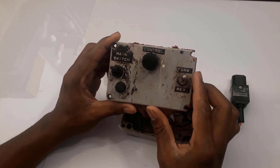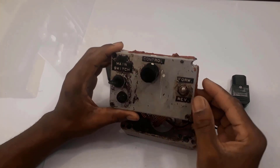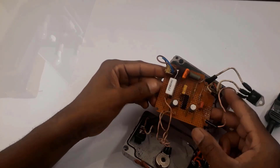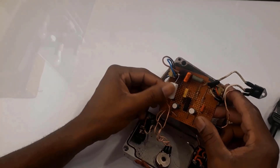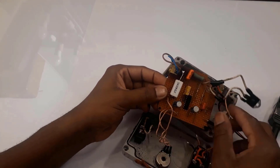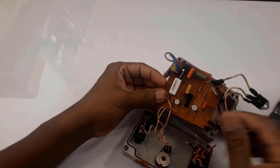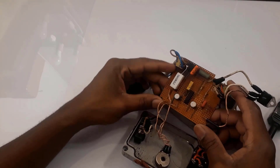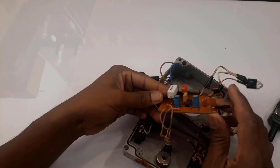If you like this tutorial please give it a thumbs up and don't forget to subscribe to the channel — that would be highly appreciated. I opened it up and found there was some burnt area on the strip board, and there was one resistor that I took off and replaced with a similar one. It's the main resistor that is dissipating most of the power for the current that the driver is drawing. As soon as I replaced the resistor the driver was working.